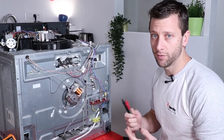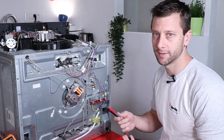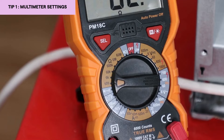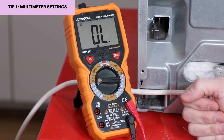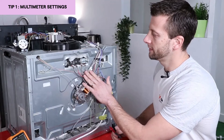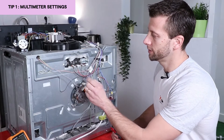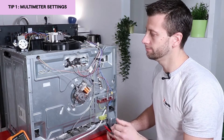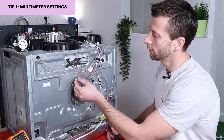I'm going to explain how to test if they are short-circuited. When you want to test a resistor to see if it is good or short-circuited, you will need to set your multimeter to the 600 Ohm position. Depending on your multimeter it may be a different range, but set it to the lowest range. To test the resistance we will disconnect the connectors. Feel free to take a picture before unplugging everything.